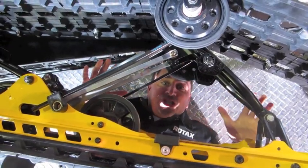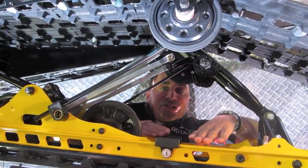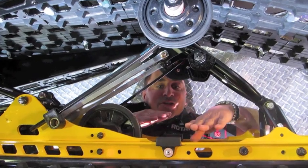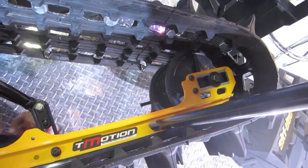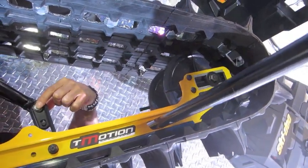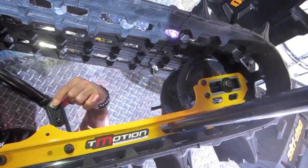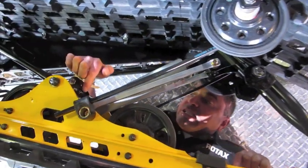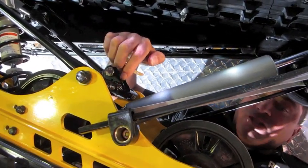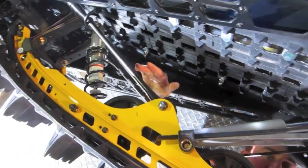You're all wondering what the T-Motion is all about. What it does is allow the rails to move four degrees either up and down — flexing it. What allows that to happen is there's now a ball joint where the T-joint right here used to be. As you move forward, here's the ball joint that moves back and forth. There's actually a split right here by the grease filler, so it allows the rails to move independently. And these have gone from round to squished, so it allows for the flex to happen.